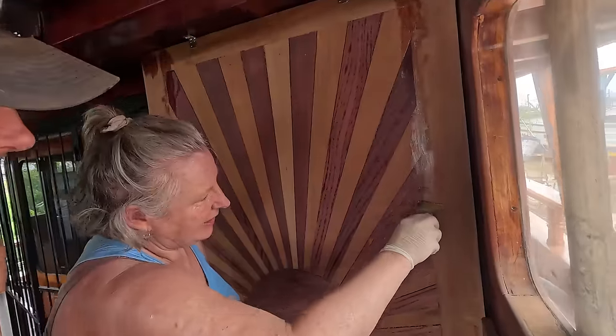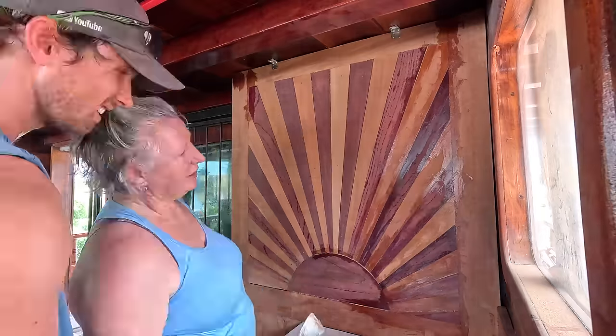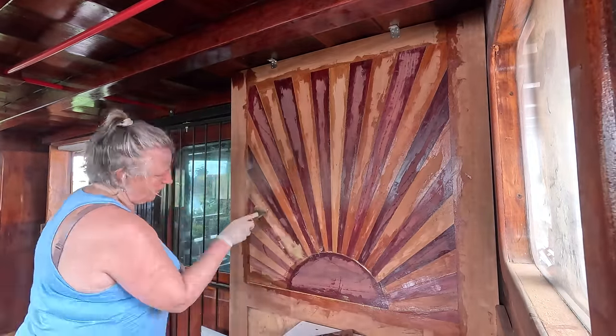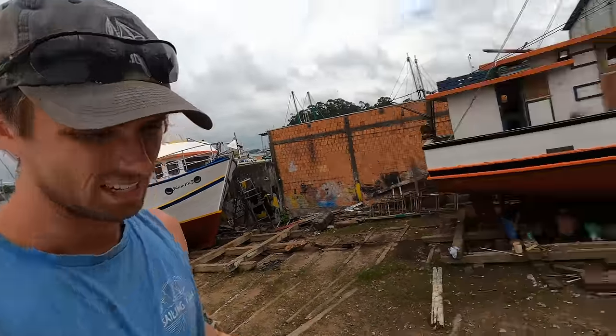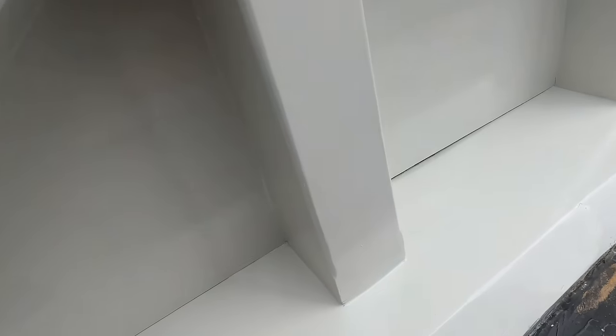Of course Nico is the one who never rests — even though we don't show him very often, he's up here on the boat making sure we have a very nice inner bulwark. He's already put one layer of polyurethane primer and one layer of polyurethane paint over the primer. You can see here it's kind of messy going on, but now it's looking stunning.